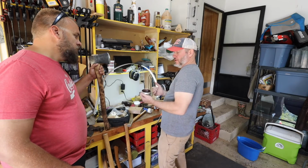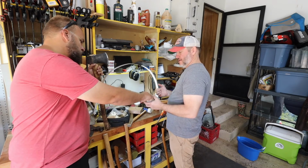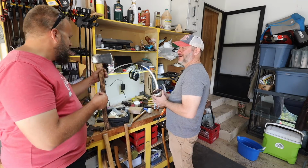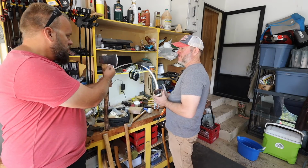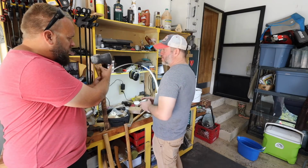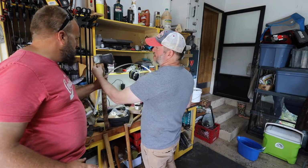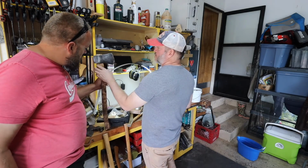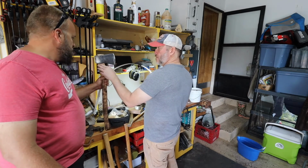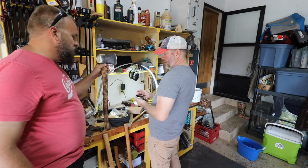It does give you a little bit of grip on an axe, so it doesn't make it quite as slick. And it smells nice. Yeah, it smells good. It's going to slightly darken it, which that oil you were talking about would do too, and it's a protectant. The pine tar really helps with that. The turpentine helps it penetrate, and then of course the beeswax is going to help waterproof it and keep it protected over time. Is this similar to using the linseed oil?